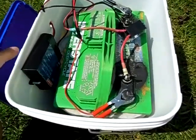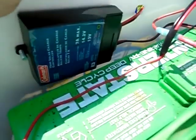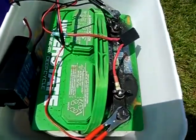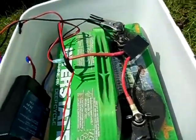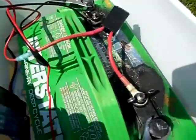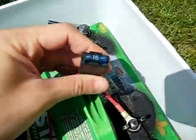Okay guys, so I got the lid off my portable solar generator here. I got me a 7 amp charge controller there — the Coleman — and my interstate battery, my deep cycle right up here. I also wired me in a cigarette outlet there. Solar panel wire comes in here through this little hole, goes straight to my charge controller, from my charge controller to my battery. I do have the cigarette outlet fused there with a 15 amp fuse.